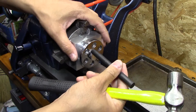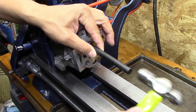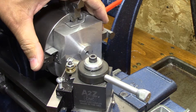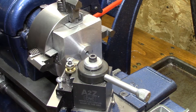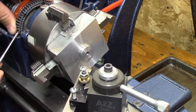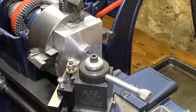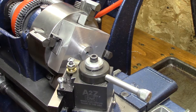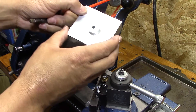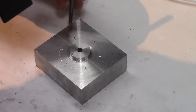It's time to trace out the circle to have it centered up. I get a center punch and just put a light tap on there. Then I take the spinner off and put it right on that punch mark and scribe a circle around the entire thing. One of the unique features about this little Atlas 618 is that it has indexing on the bull gear. I mark with a sharpie six evenly spaced holes around there — just counting to make sure — then scribe across and center punch it. Once I get the center punch marks, all I need is two of them perfectly spaced: one for drilling and one for indexing.